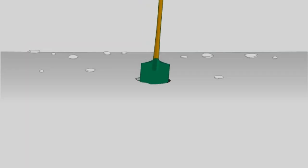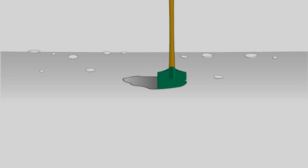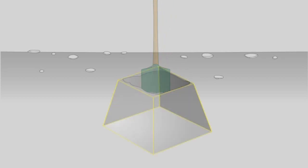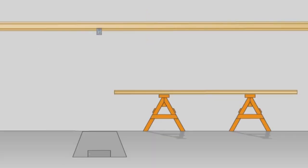Columns and footings. When affixing the columns into the ground, dig the holes to the specified size and place a half brick in the bottom of the hole. At each post location, measure from the underside of the beam to the top of the brick and cut the columns to length. Check to ensure all columns are level.